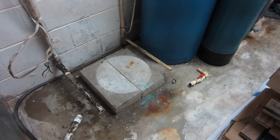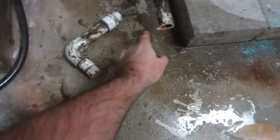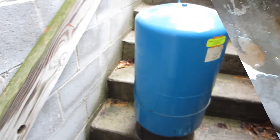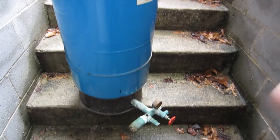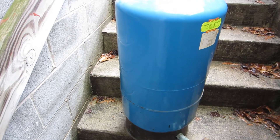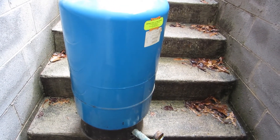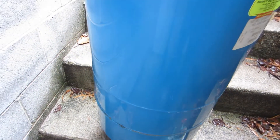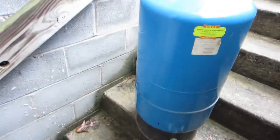We got a bit of a mess, but at least it's out of here. Just a little caution — when you cut these pipes on PVC, make sure you clean them out. You don't want those little fuzzies stuck inside your pipe because they get into your system. In our case they'll immediately end up in our water softener system. Now I just got this thing out of here. I noticed when I picked it up that it weighed about a hundred pounds — these tanks are almost weightless at about 10 pounds when empty. I drained it, yet it still weighed that much, which definitely means there was water in the top side of the tank where there shouldn't be. So it definitely was bad.